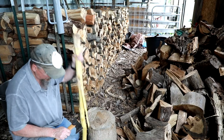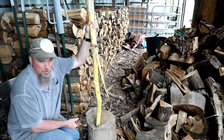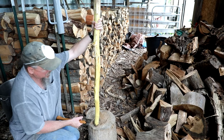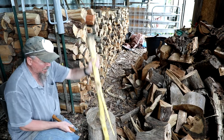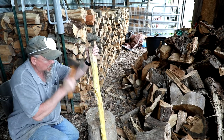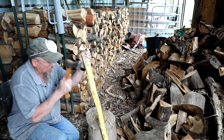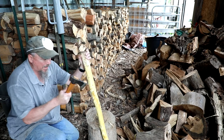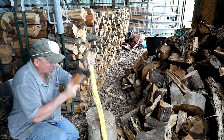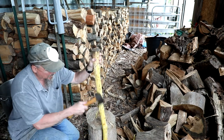I had to do a little bit of a reset. I was having a really hard time getting through that second layer of bark with my belt sander — it's just not powerful enough. So I came back out and took a draw knife and got most of the rest of it off. There are just a couple more knots; I usually just chop through them, and then the belt sander will smooth them out. It's looking pretty good — those bug holes kind of give it a little character.